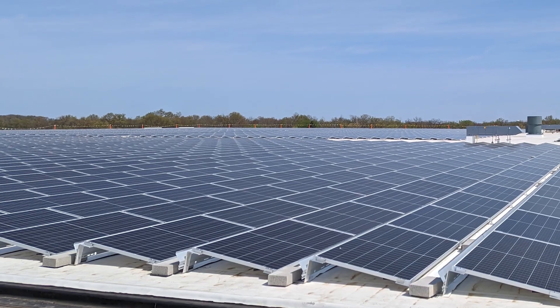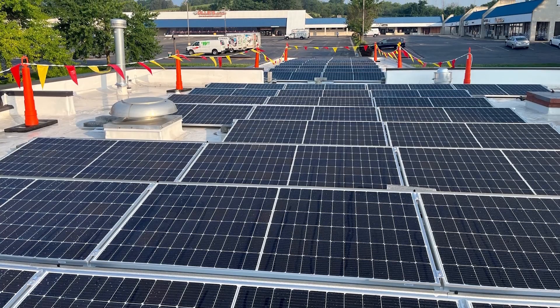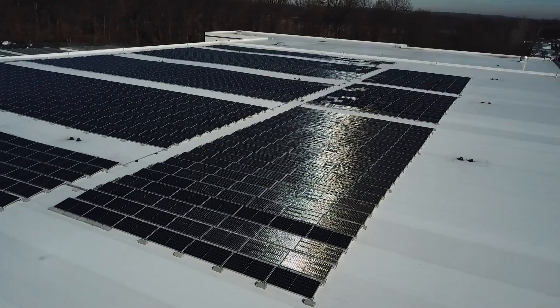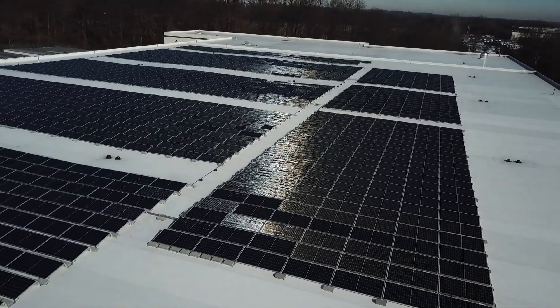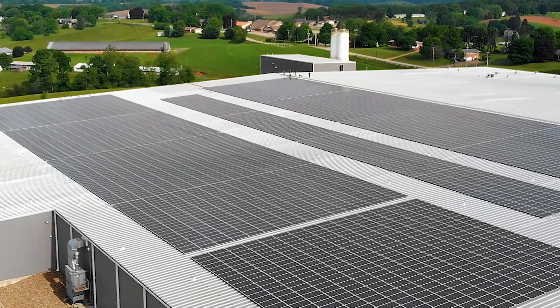In terms of cost, Larry, what does it cost to install a solar system on a flat roof versus a typical shingle roof that's at an angle? So flat roof versus shingle roof — the flat roof is going to be a little bit more expensive generally, especially smaller systems. Smaller systems on a flat roof require more ballast block and require the same amount of engineering as a big system, so smaller systems can be more expensive. Larger systems are going to be a lot closer. Typically ballast is going to be your most expensive, then shingle, then metal roof. The cost difference between a ballast mount on a flat roof versus a metal roof is probably going to be in the range of about 10 cents per watt, just to give a general idea.